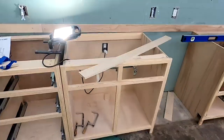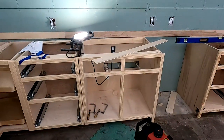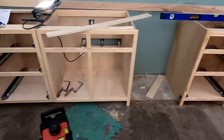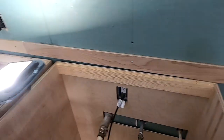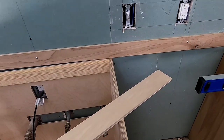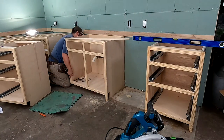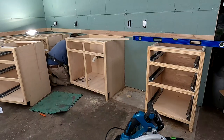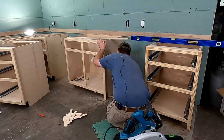We're going to level this guy up. You can see that's where my dip majorly starts — you can see the crack in the concrete right there, and that is why. That is about an eighth of an inch low right there, and I know my board is level. This is basically a ledger board except I'm using it the opposite way, and then I'm going to make sure I'm level in all directions.